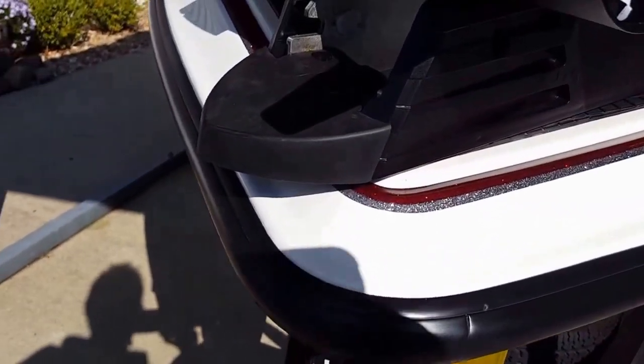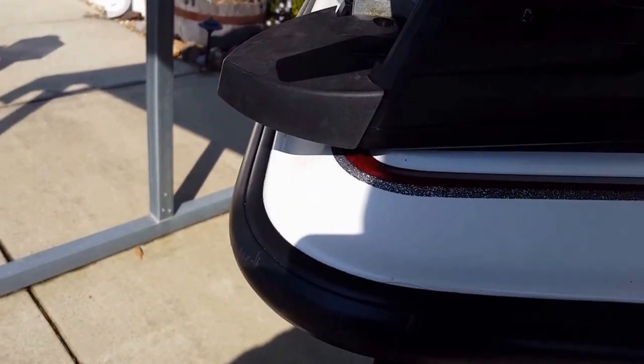You can see here how that sticks off about that far. It wouldn't fit in the motor guide mounts, and it wouldn't fit in a Fortrex mount. And you can see there's the holes down into it. I have a hole that's out here on this outside bracket. The outside bracket out here, you take off this plastic piece here, then there's a metal bracket under there that you take off, and you remove those two and you get access to 2 holes down there. So I've got one of the hold down bolts right down in here underneath this plastic bracket. Then I got the rest of them.